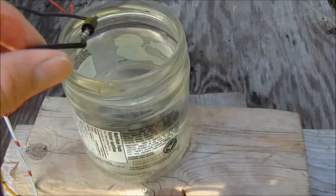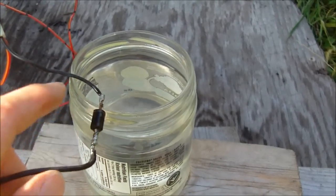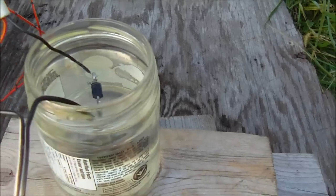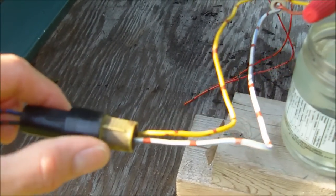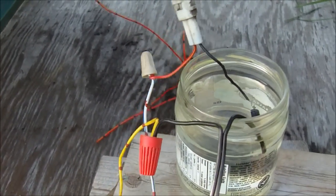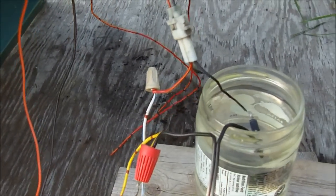Unfortunately the diode I have can't handle the current flowing through here — it was getting so hot that I had to actually cool it in water. When I dunked it in, it sizzled and steam came off. So I've essentially liquid-cooled this diode, but I'm going to have to get a heavy-duty diode for this. I also have some automotive plugs from random cars — these are from a Pontiac Firefly. They have rubber seals in them so they're an okay plug to use, but you could buy proper solar panel plugs.